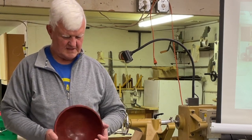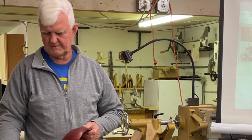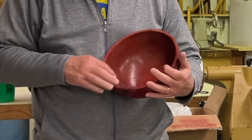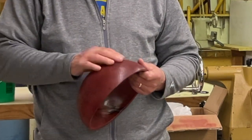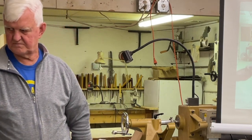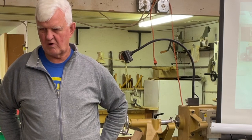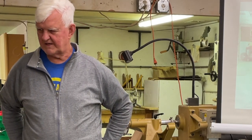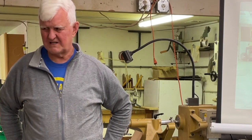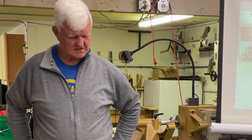This is another dye job. Oak dyes readily. This is just done with a brush. You get your alcohol, mix your alcohol with your dyes in the color you want. This is mostly red here — it's not tear-out, the wood was just a little rotty. I believe this is red oak. Alcohol doesn't raise the grain — very little. That's one of the problems with water stain. Water penetrates a little better but you have to sand it all back down anyway. I just brush it in; it soaks up very quickly, and alcohol dries quickly. It makes it a lot easier to use compared to regular oil stains.